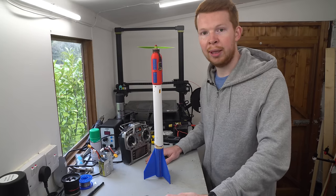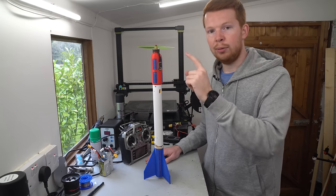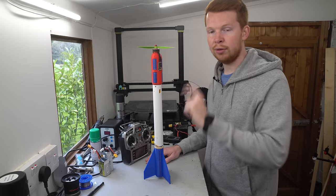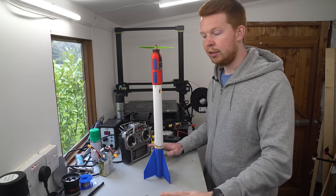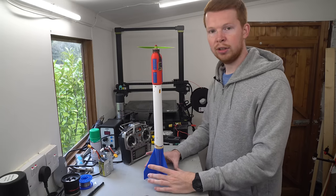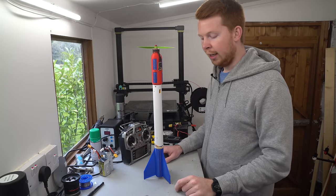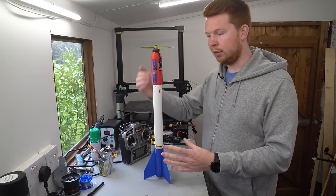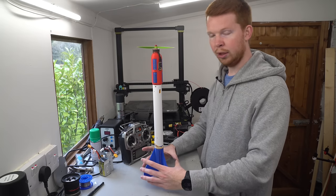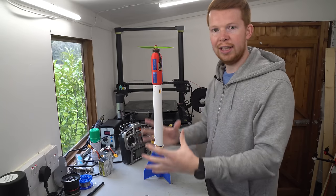Here we have the finished super capacitor rocket. At the top is the motor and propeller — the thrust unit. The reason it's at the top is not for stability reasons; if you research the pendulum rocket fallacy, the reason is clearance issues. With the propeller at the bottom I'd need big fins around the side and a guide rail no-go zone disk as the propeller rises from the ground, so having it at the top removes any clearance issues.